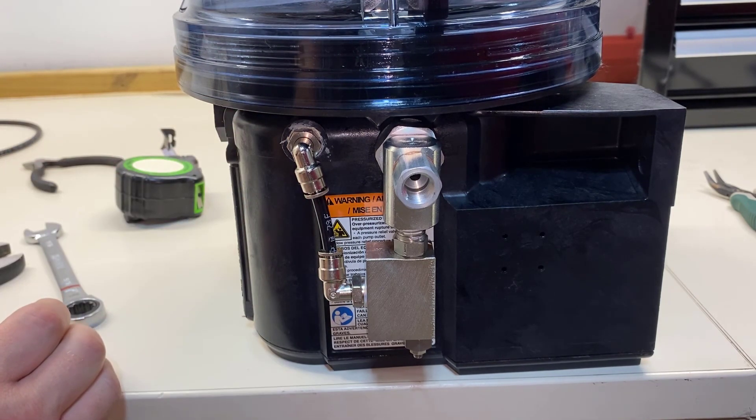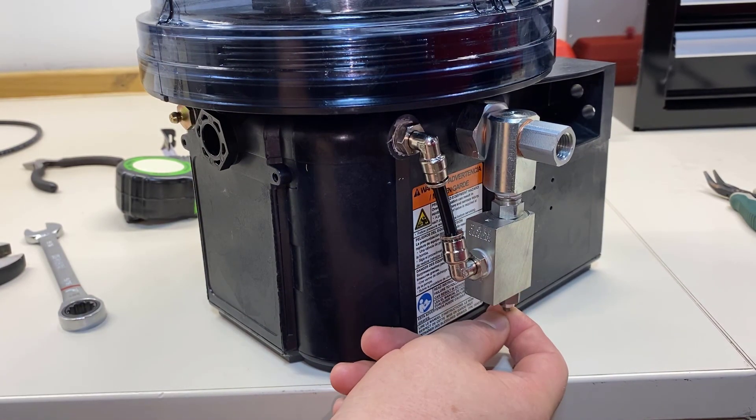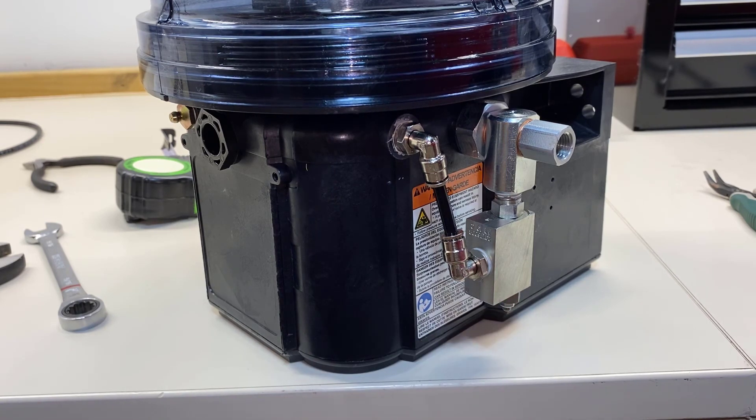Any oil or grease that returns is just going to be going right back into the reservoir. That's all there is to the return-to-reservoir relief valve. From here, the adjustments are made down here — there's a jam nut that you can remove and adjust. It comes from the factory set at 3000 psi, and most people leave it that way because they're typically using hoses or tubing that can handle the pressure. But if you happen to be using this on a lower-pressure system and need to adjust it so that it opens before your tubing bursts, that adjustment is made down here. Hopefully you found this video useful and educational. If you have any questions about this or any other subject related to Graco Industrial Lubrication, please feel free to contact us — we are always happy to hear from you.